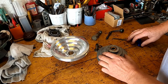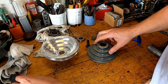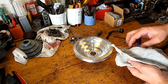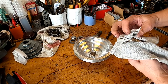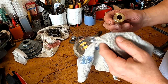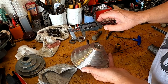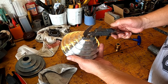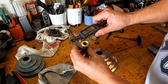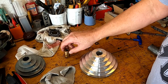That's in there good — let me see if I can tap that out. Just like that. You can see where the Allen screw was mated on there. It's not going to drop in there. Interesting — this one is 936, and this is 1.02, so we're going to have to open that up a little bit, or turn this down.